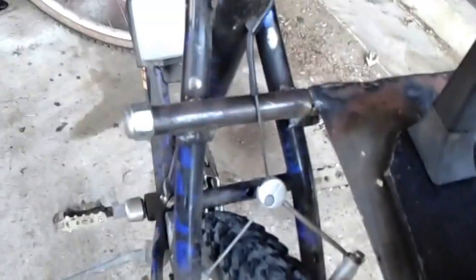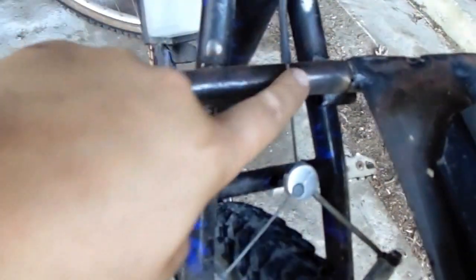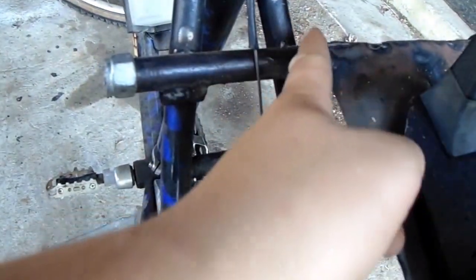My dad and I built this — he welded everything. So first, if you look at this pipe right here, we first welded that on, and it cuts right there. That was welded to the frame, so that's very solid. Then over here we got this nice piece of sheet metal, and another pipe is welded on the bottom right here. We have a bolt going through, and this thing works like a hinge. We also put a piece of angle iron on that sheet metal right there, just to give it some support. It welds onto the bolt and goes all the way up to the end.